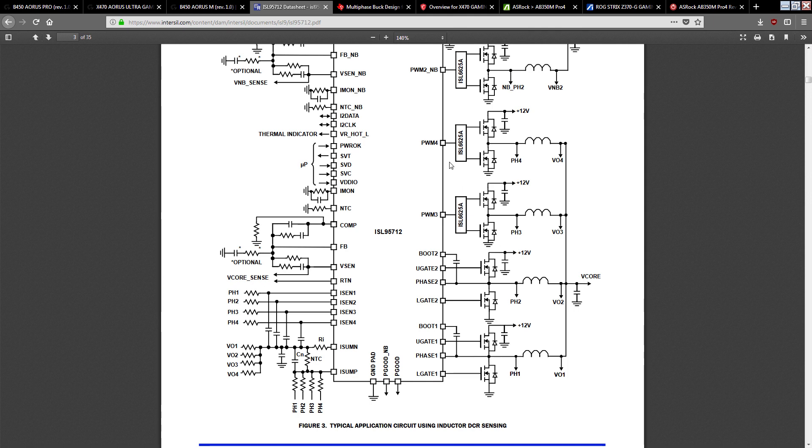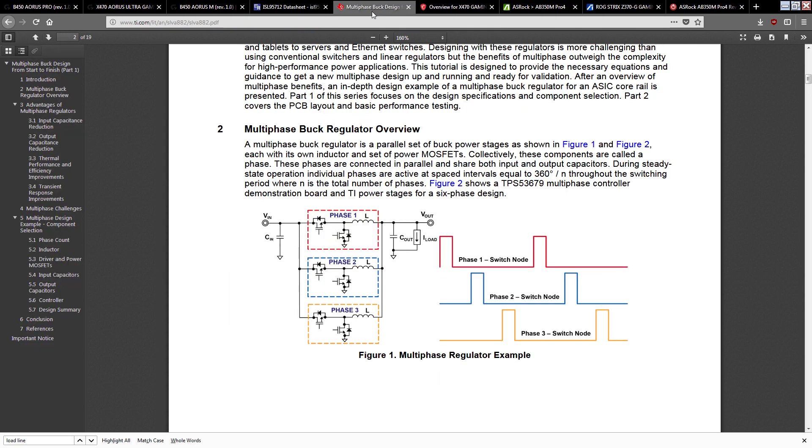You can't double off this chip because you'd end up with an asymmetrical monstrosity. From an economic standpoint there would be no good reason to do it — it would not give you any real advantages in the real world. The voltage controller would still see 4 phases, and then you'd have two doublers causing four phases to be interleaved differently from the other two. It would just be a mess. So let's take a look at how a multi-phase buck converter is supposed to be designed, using a document from Texas Instruments.